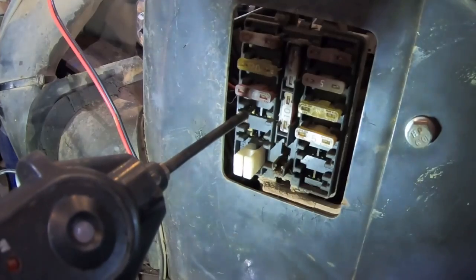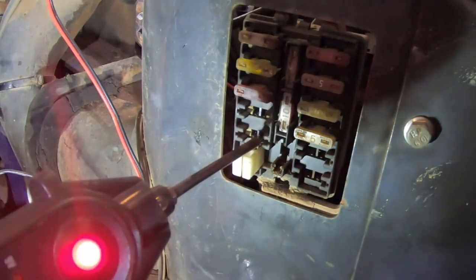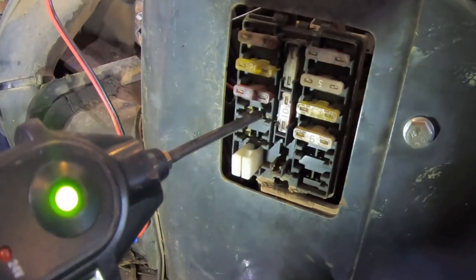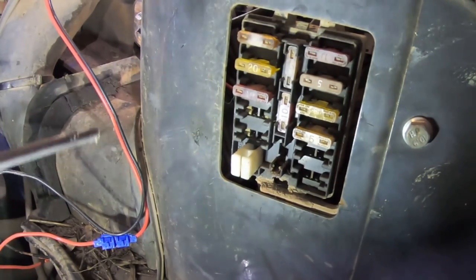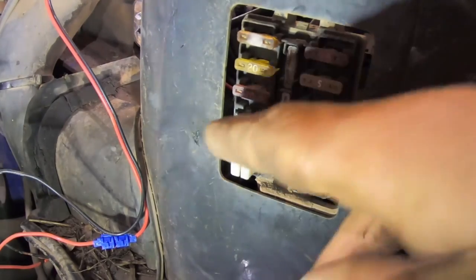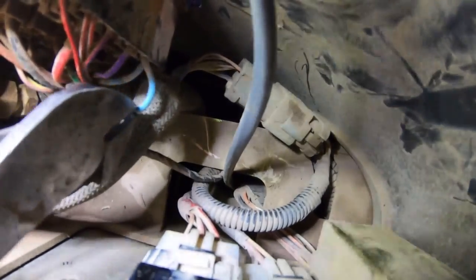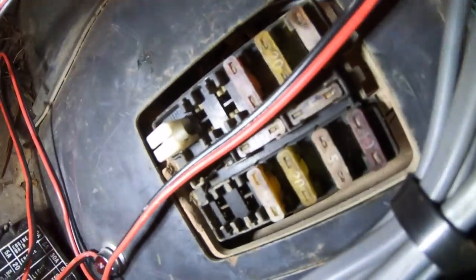Okay. So we can hook up to there or we can hook up to there. Because with the ignition on, that becomes power. And that becomes power. And with the ignition off, it turns into ground. Which is fine. That way we won't have any parasitic draws all the time, just in case. Okay, let's hook that up. Let's grab one of these blue wires here since we got a little more slack. Alright, that's going to be our power source. I'm confident that's not going to mess up anything because the machine didn't have a fuse in there in the first place.